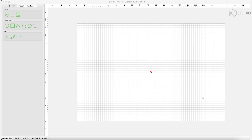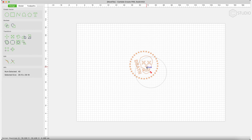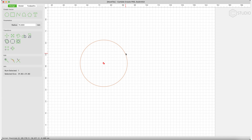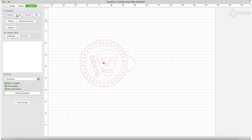One of the first challenges you're going to encounter is how do you work-hold this particular copper coin. I have a solution for you, and it's all about centering. Center your end mill on your stock, make a circle at the exact circumference of your coin, and center that on your stock. Then center your art on that circle — everything is center, center, center. Copy the outer circle of that coin and move all of your art to a layer that you can hide. Now you're looking at a circle that's dead on the center of your art as well as the art board. Create one more circle, and add a little tab so you can pry out the coin later. Bring your art back — everything is on center, and you have a selectable pocket that you can cut as a separate program. Then come back, redo your Z, and cut your coin. You'll see this setup throughout this video.